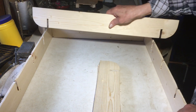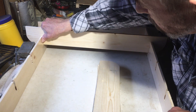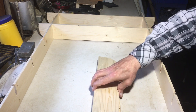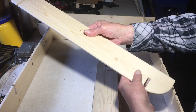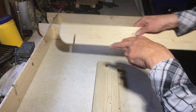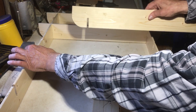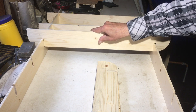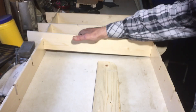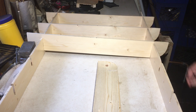It's a very neat way to assemble shelving that doesn't require any fasteners. The pieces of wood can actually fasten themselves by the way they've been cut — just half notch: half this here and half that there — and of course the width matches the thickness of the wood you're working with. It's very easy, very neat, very simple way to put together shelves. Thanks for watching, bye bye.